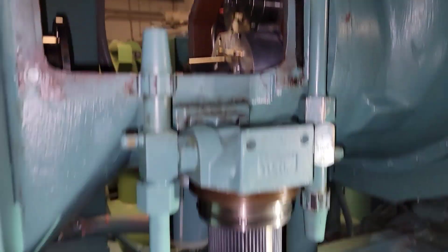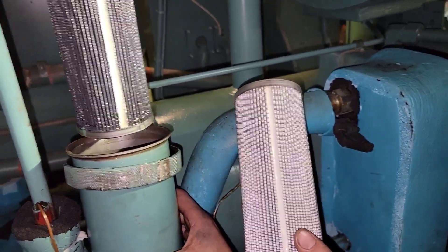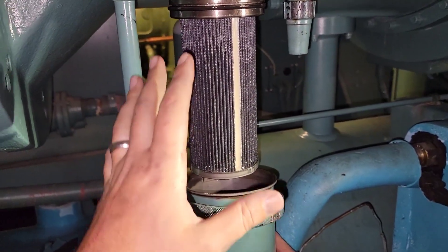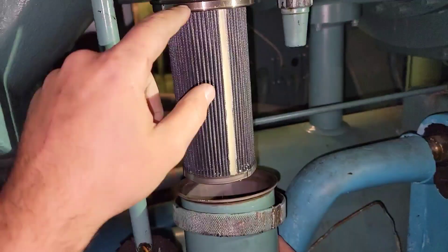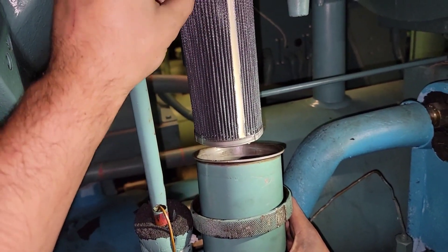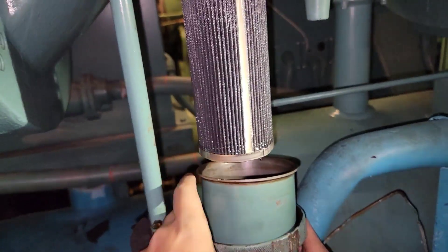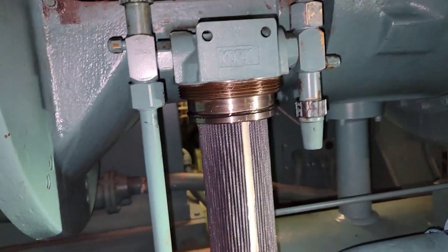Shaft seal is in and complete. We're in the process of doing the oil filter now. This filter looks a little dirty — it's darker because it's got oil on it. It's got a lot of hours on it anyway, so we're putting in a new one. We'll also change this O-ring while we're here. This seal does not require a tremendous amount of torque — it seals via the O-ring, not the threads. For some reason the last person that did this didn't understand that, the O-ring is bad, and they clearly over-tightened it. Don't over-tighten this — if you have a bad O-ring, replace your O-ring.